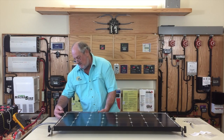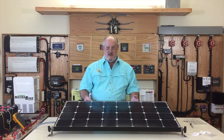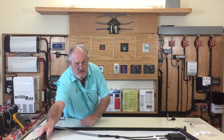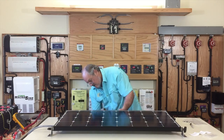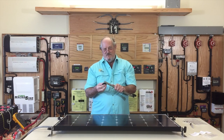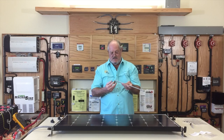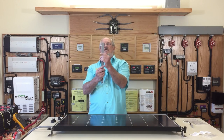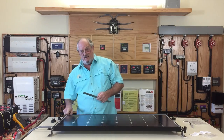Now the panel will tilt up and down. This is really handy for more than just tilting in the winter — if you want to clean behind the panel, it'll flip all the way over and you can check the wiring or do a number of things. I want to introduce the tilt bars. It's super simple — we just calculated the length of this bar so we can tip this panel up 45 degrees. It comes with its own knobs; two bars, one side is just a hole, the other has an embedded nut.